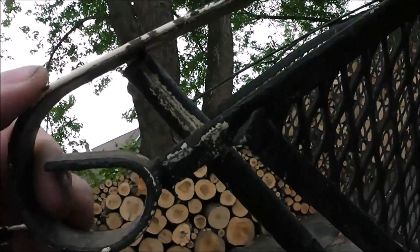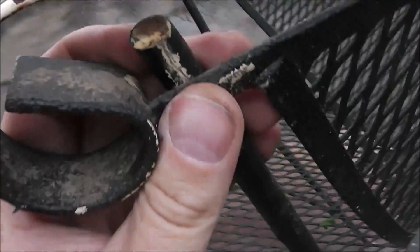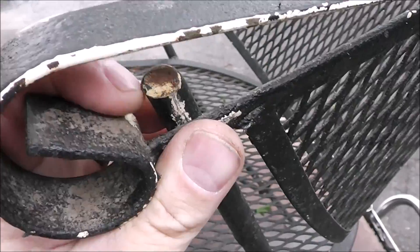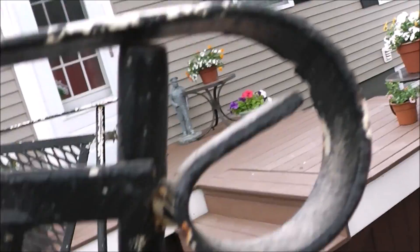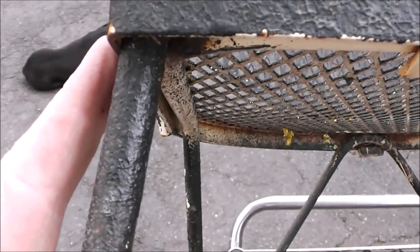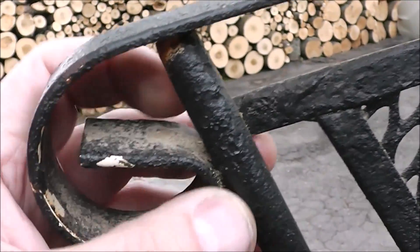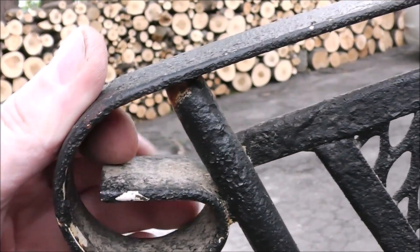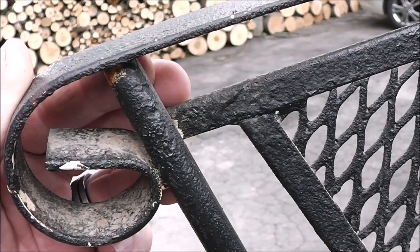The next thing we're going to do is take a wire brush and try to clean everything up. You can see we've got a break there — this material here is solid, and the rods we've got to weld to are solid. We've got another broken weld here and here, and another one under here. A 6011 rod is going to be perfect for this because it's really forgiving on paint prep and cleanup, a lot more forgiving than other rods.